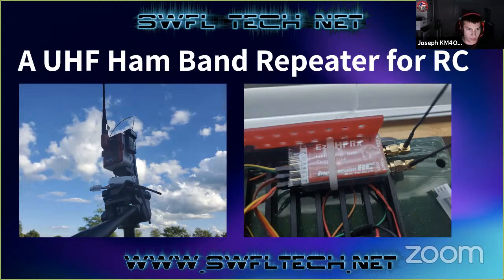So these little UHF modules too, they also have stuff like head tracking and fail safes in them, which is pretty cool. Fail safes are very important for models. If you lose signal, you don't want the truck to just continue moving. You actually want it to stop. Otherwise, it'll drive into the ocean or something. But that's the little repeater system I have there.